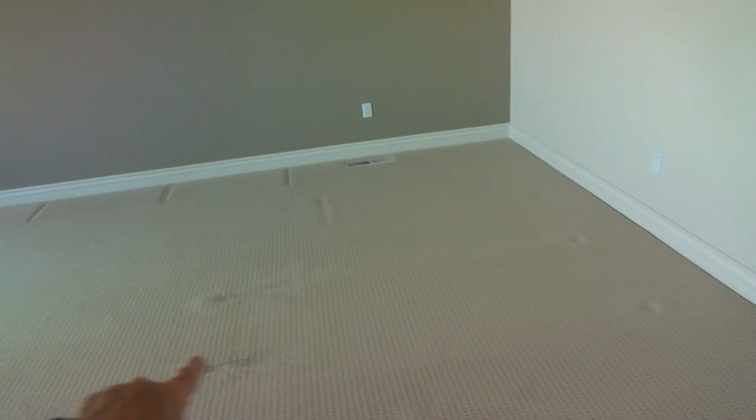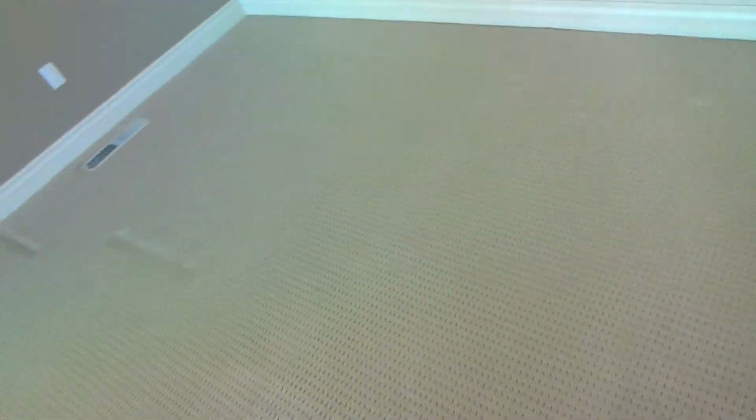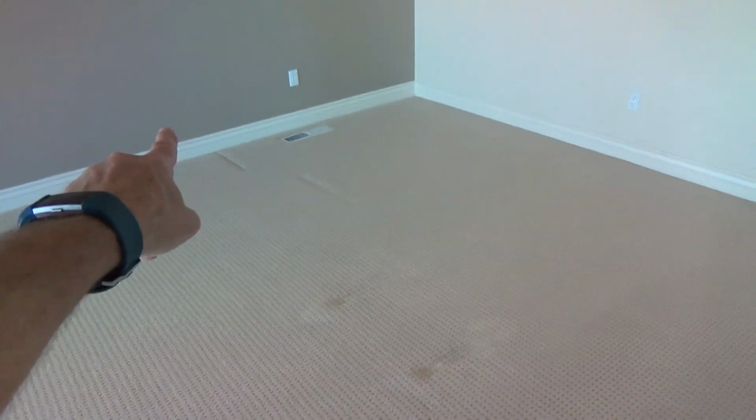They used to have a treadmill right here, and it puckered the carpet there, and I can feel right there where the carpet pad's just been kind of wasted, and right here. In fact, before the carpet guy gets here, I might ask him to bring a couple little pieces of carpet, because remember, he's going to pull this back. He's going to re-stretch this area. So when he pulls the carpet back from this edge, maybe have him roll the carpet out this far, and then have him look at the carpet pad there, maybe patch that before he pushes that back.